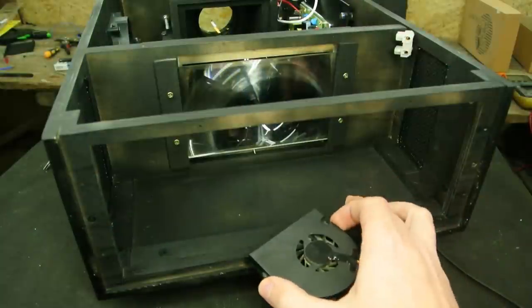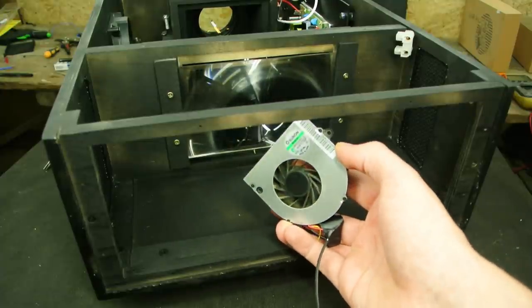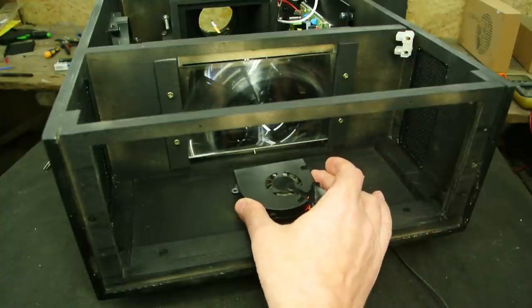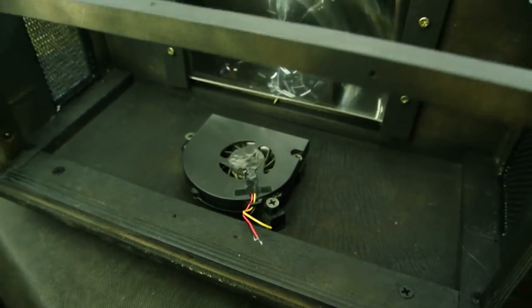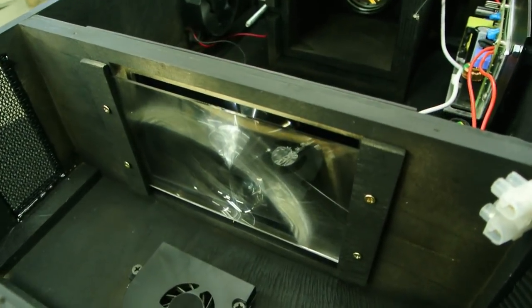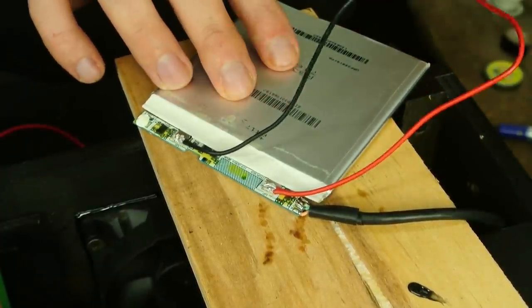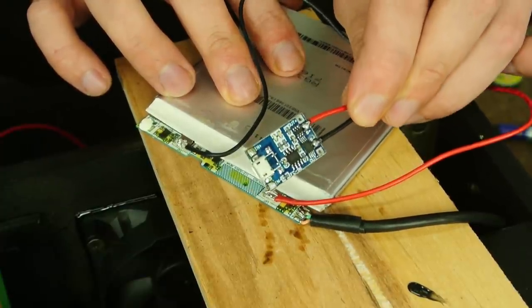After replacing the diode, I noticed that the matrix was overheating. To solve this problem, I had to install additional cooling in the form of a laptop fan. The charging of the tablet's battery will be done directly to the battery controller, through a charge controller from AliExpress.